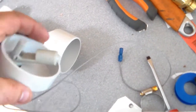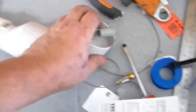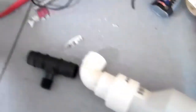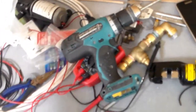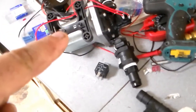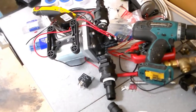This will form like a sump. I've got a cap on the end, and on the end there I've got just a float switch — so as the water fills up, this comes up and engages that switch, and that will run through this relay, which will then switch on this pump. That will suck all the water out and pump it through to the grey water tank. That pump flows at exactly the same rate as the pump that's feeding the system, so the flow rate will be the same and it shouldn't back up at all.